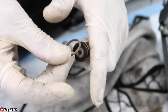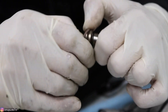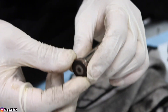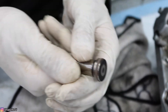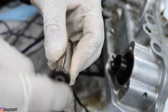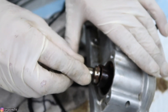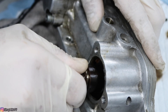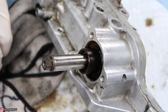Now we're going to take the Teflon seal and stretch it over the top. The thing with the Teflon seal is it will deform a little bit when you're stretching it. In order to get it back to the proper size, we're going to insert it back into the cylinder and just let it sit in there for a little bit. Get some oil on it and insert it in, and let it sit in there for a minute or so.